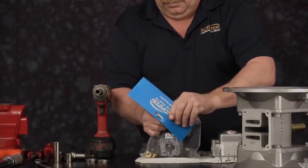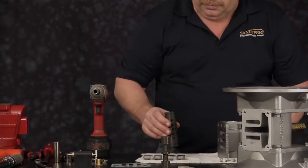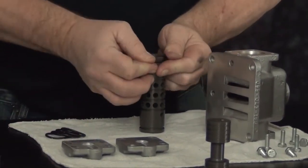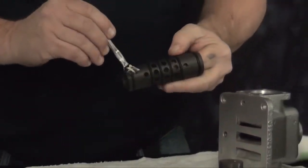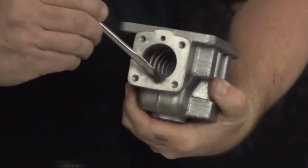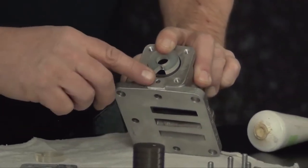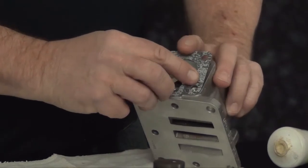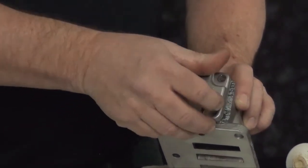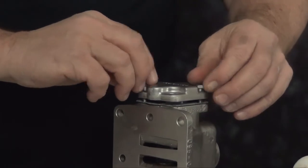We're going to open our air end kit. This kit contains everything Sandpiper recommends to rebuild the air side of the pump. We're going to start with the air valve assembly. Set the sleeve up and install the six O-rings on the sleeve. Put a light coating of grease on each O-ring — the grease keeps O-rings from catching, binding, and cutting during installation. Also put a light coating of grease on the inside of the bore of the valve body. Install the sleeve into the body — this is self-aligning. Once the sleeve is in, set a bumper on top, then the end cap gasket and an end cap. Make sure to line up the pilot passage in the end cap. Install the cap screws and run them down tight.